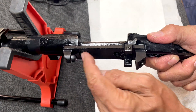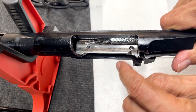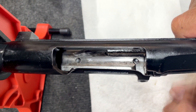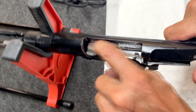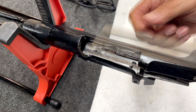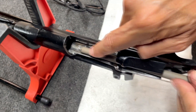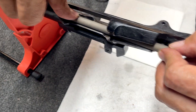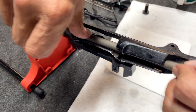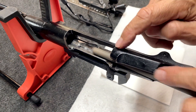Where we put the screws through the scope mounting, on the inside of the receiver, you can see where these screws are, and there are some burrs on here which will interfere with the movement of the bolt. So we've got a little round stone and the thing is to get in here and just smooth that nicely and remove any burrs around where those screws have come through.